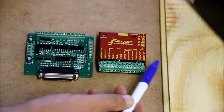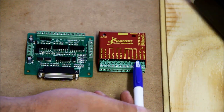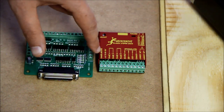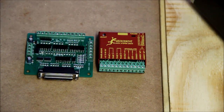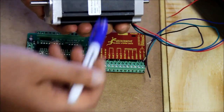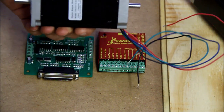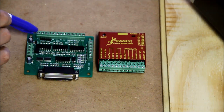Now we need these pins to connect to the driver. On the driver it's got a thing called direction and step, plus a disabled pin which I don't use, and a common. We run power into the driver, plug our motor into phases A and B, and I'll show you a nifty trick to determine which is A and which is B. The motor has two coils — that's how it works.